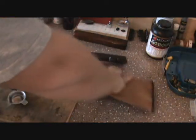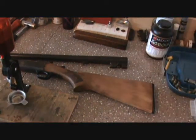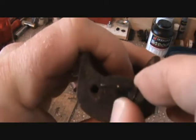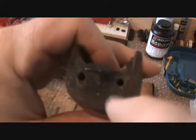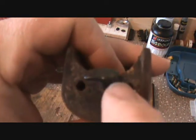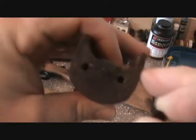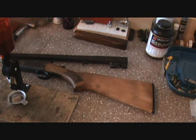We'll do two Stevens shotguns at one time. It was missing various screws — these holes are stripped out. These are the original screws that go in it; when you tighten them down, they just slide right in and out, there's nothing to hold them. So what we're gonna do is fill these in with a wooden dowel and wood glue, then redrill the holes so we get a tight seal. I'm going to replace a few pieces of hardware as there are various pieces missing.